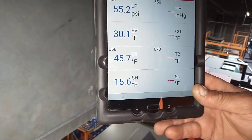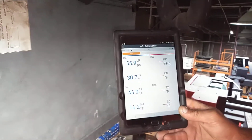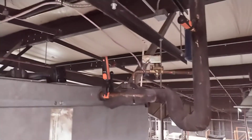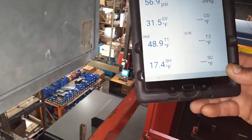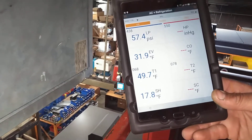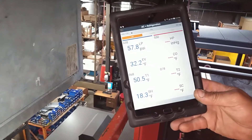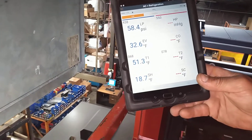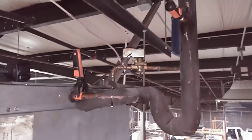We'll make small adjustments at a time to the spring pressure on the TXVs. After 21 years of operation it's possible that the springs have lost a little bit of tension, and perhaps the diaphragms are getting a little worn where the rods contact them, resulting in a little lower superheat than we want to see. This one seems to be going up and down between about 15 and 20 degrees, which we're good with. Thermostatic expansion valves will hunt up and down slightly depending on the load — that's all in the design by the manufacturer based on the size of the TXV, the orifice size in the nozzle distributor. They're never 100% steady state, so we just make sure we're operating up and down within an acceptable range. And that's a little bit about adjusting thermostatic expansion valves.